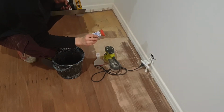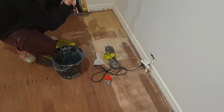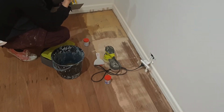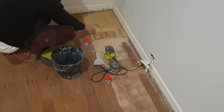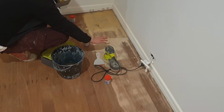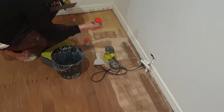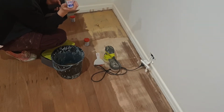So this is the brush box. This is the hardwood. And this is the teak or cypress colour. The teak's pretty orange, and we knew straight away that we weren't happy with that colour. The hardwood's kind of that wood putty classic colour. It's quite light, so that doesn't blend well with our floors, but we found that the brush box was the best match in terms of puttying the holes.